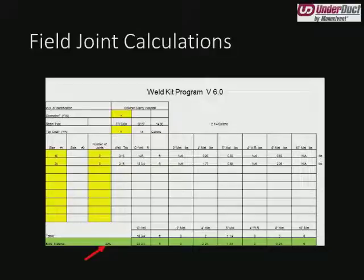Here we have our field joint spreadsheet. This helps us determine how many pounds and feet of glass, resin, catalyst, etc. will be needed for the project, and breaks out how many joints there are of each size and how much material each joint should take. This is something we provide on our website — the instructions direct how many of what kind of layer go on each joint, and the directions are also provided with the project when it ships to site. One important note: we always calculate exactly what we'd need if everything went perfectly and then throw in an extra 20% field joint material, as a factor of safety.